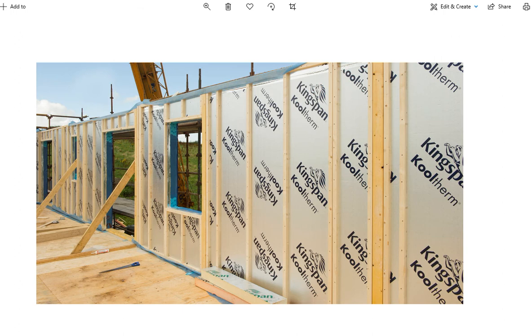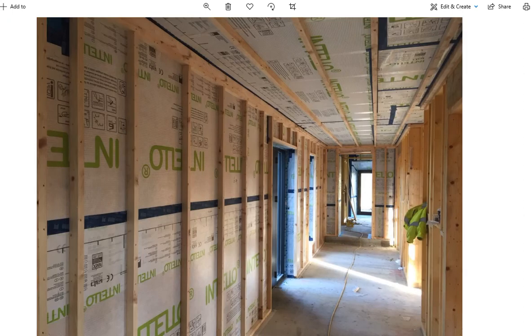Back inside the house then, in between the studs of the timber frame wall we pack insulation, so thick insulation. So if your timber frame panel is maybe 150 millimeters thick, you'll have 150 millimeters of insulation. If it's 200 millimeters thick, you might have 200 millimeters of insulation. We put a service cavity inside then. So inside in the house then, we have our service cavity.